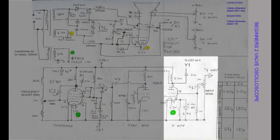The last piece of major circuitry in this project is the Y amplifier, and to be honest, it's probably the area where the more advanced scope user might wish to improve upon with a slightly more complex circuit. The current issues? Well, this one is relatively insensitive and overloads quite easily. With that said, once one understands its limitations, then it's perfectly usable in many test and measuring instances.